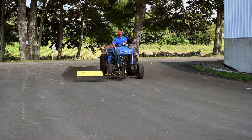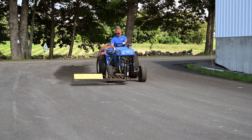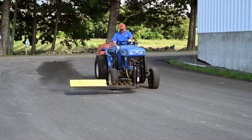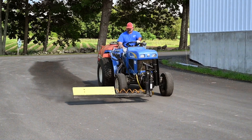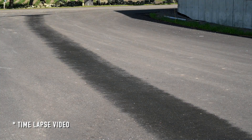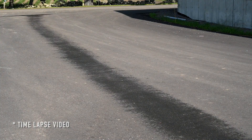By taking the sprayer and spraying on the blacktop on a nice sunny or dry day, we can watch the pattern of the spray on the ground and how it dries. The more uniform it dries, the more uniform the application.